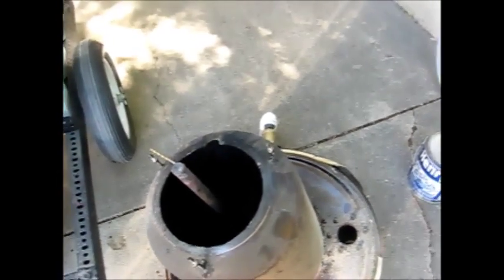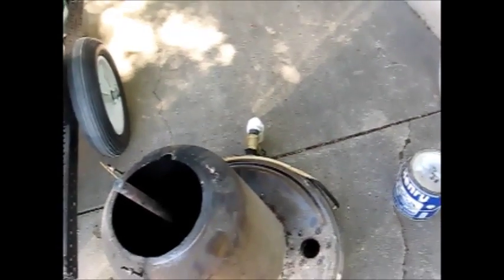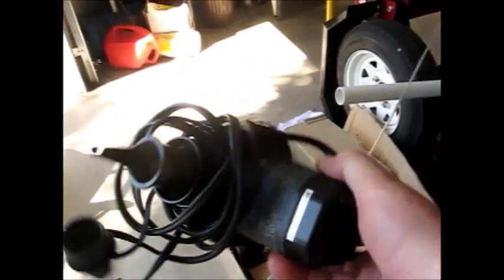I need to find a different blower motor than the ones I have — they just don't put out enough pressure. I've already spent upwards of $200 on different blowers. I spent $80 on one of these little blowers that doesn't put out very much at all. It puts out 57 CFM, but the pressure is very wimpy — less than a quarter of an inch of water — so I'm not happy with it.